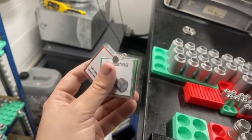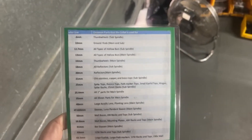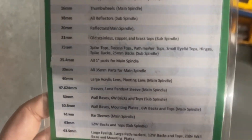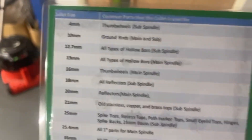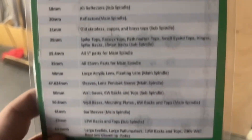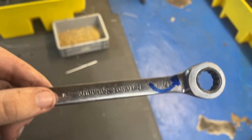I've made a sheet explaining what each collet is used for — the main parts and some common parts and where they'd be useful. This is mainly to help you out when you grab a bit of bar and need to set up, and you don't know what collet to use for that part, so you refer to the sheet. Nine times out of ten the part you want to set up will be on the sheet.